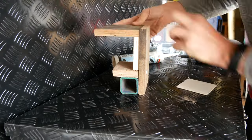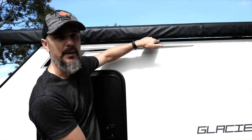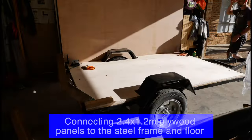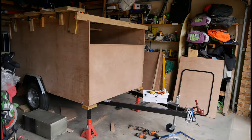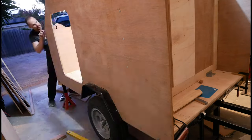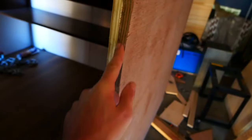In this clip I'm using a miniature model to demonstrate how it all fits together. The interior consists of two compartments: the sleeping quarters which is about two meters in length and the kitchen compartment which is about 0.6 meters in length. I also left enough clearance inside so that it doesn't feel claustrophobic — the square drop box itself is about 1.3 meters in height. To connect the side wall with the back wall, front wall, and room dividing wall I used special 14 gauge hex self-embedding galvanized batten screws.